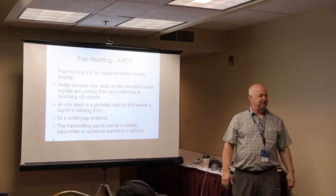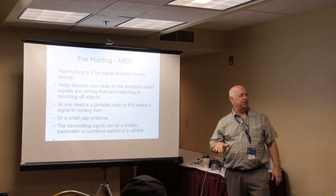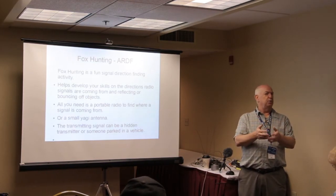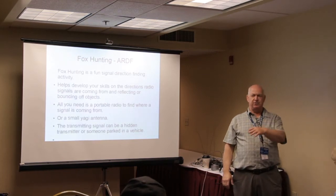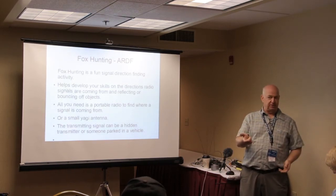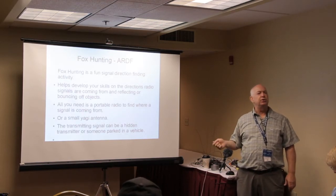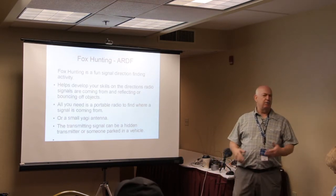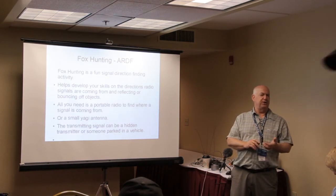Yes? So how do you know what frequency it's on? You set the frequency. Yes, I set it. The national fox hunting frequency is 146.565. That's what they've come up with to do it. You can do it on any frequency. We have people that use that frequency just to chit-chat simplex. But with the low power, I don't really bother them, but we can hear them when we're out fox hunting, talking, and they're like 15 miles away, but we're still picking them up, and it kind of messes you up a little bit. But you learn to get it. It makes it fun. And I pick other frequencies that nobody's on. I'll do it on 70 centimeter.